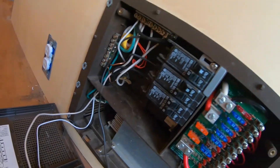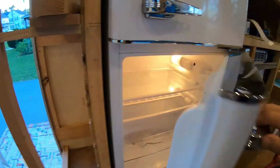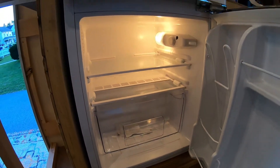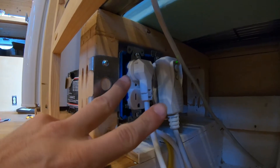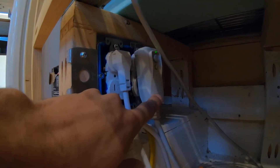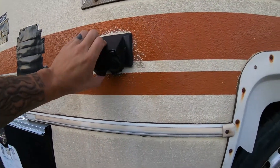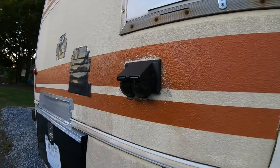That would be our very new circuit, which is the fourth one down. Mini fridge is on. I wired in this box right here — it has two receptacles because these plugs are so large. This one goes to the refrigerator, this one is for the air conditioner. We also have our exterior power — this little cable goes to the outside, which is this receptacle that I actually refurbished. This is the original exterior outlet on Chappie.